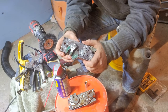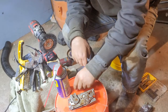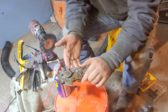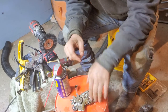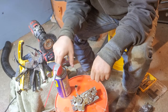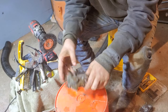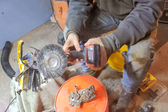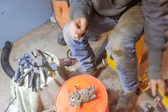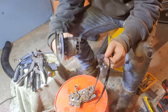All parts from your normal hardware store. Let's start by going over the tools we're going to use. The main inhibitor with these is rust — the rust seizes the mechanisms and that's what causes them not to function correctly. I've been bathing my latch assemblies in a concoction of WD-40 and PB Blaster hoping I wouldn't have to rebuild them, but it didn't work. You're going to need a wire wheel on a drill, a standard wire brush, safety glasses, and an angle grinder with a cutoff wheel.